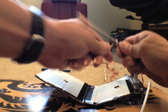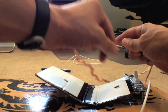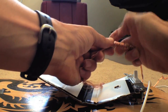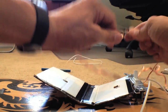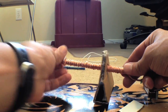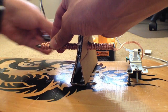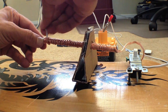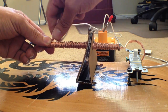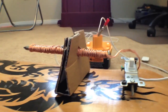Then you want to take your fresh copper wire and wrap that nail up really tight. The more coils you have around your nail, the stronger your electromagnet is going to be. So wrap that copper wire really tight, just as tight as you can get it, then put that nail down on that cardboard — just kind of wedge it in there. Then take one end of the wire and connect it to the plus side of the battery and the other end to the negative side. I have a little switch in place so I can throw the switch and turn on the electromagnet.